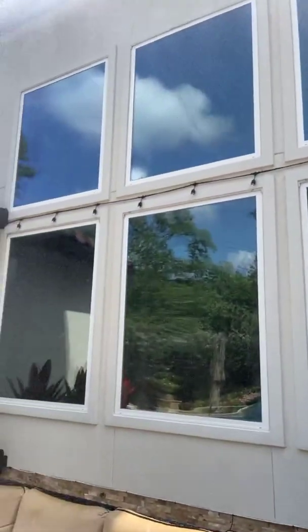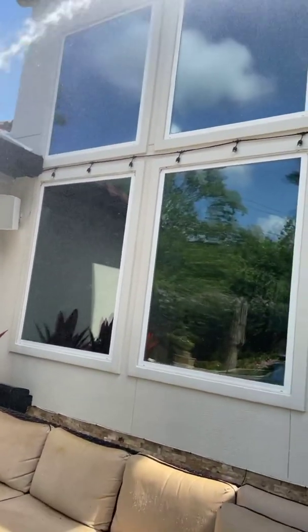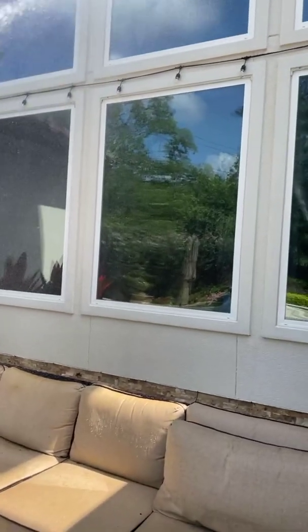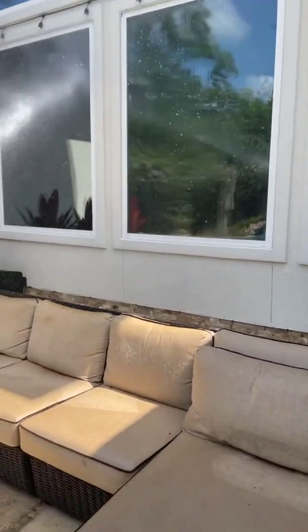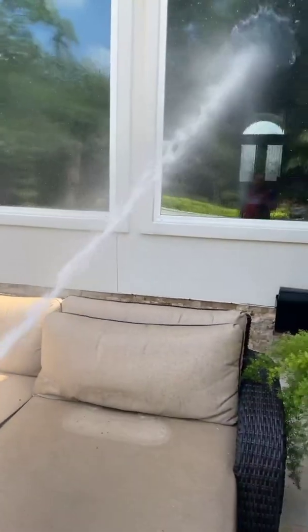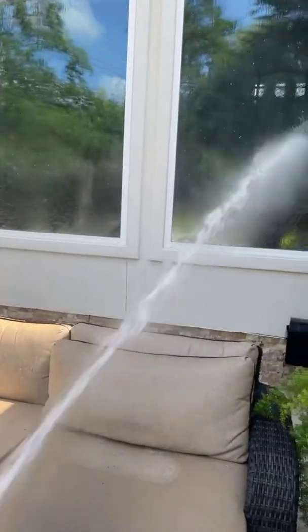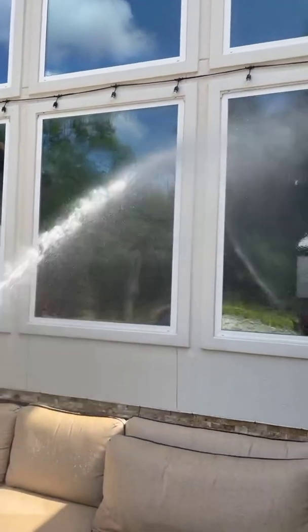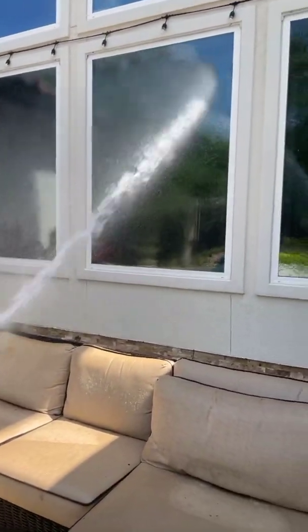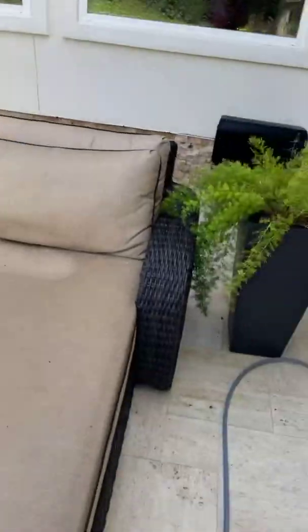I do like it better than running a GX 390 with the same pump. We use a 16-inch Whisper Wash with the GX 390 and a 19-inch with the Predator, so there is a horsepower bump — and it matters. If you're on a budget looking at buying a four-gallon-a-minute setup, I'd recommend looking into the budget build if you have space for a small buffer tank like a 65-gallon.